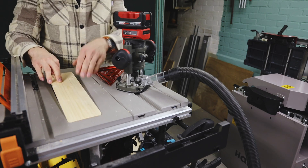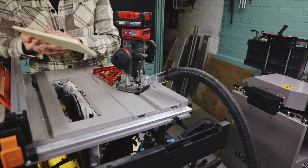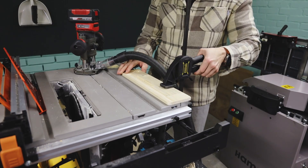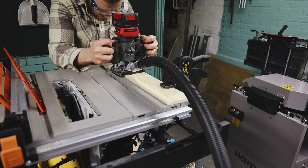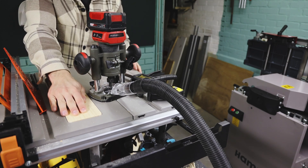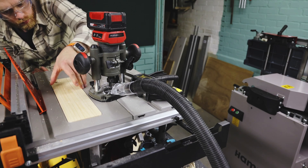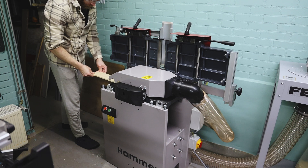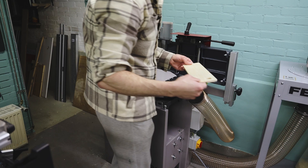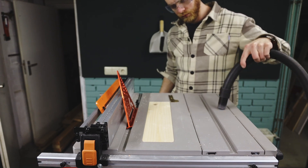Getting a bit frustrated here. I tried giving it a harder tap to make an indentation to see where it's still catching, then I realized there was a small bit in the bottom. I'm just going to route that out a little bit. Now I'm hoping it will fit — and look at that, the bottom bit fits first try! It still needed to go down about a millimetre, so I decided to take it to the planer again. And get it down a little bit more and test with it. I was quite happy with that — I'll take it down one mill.